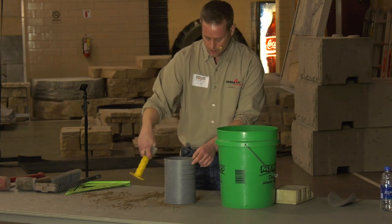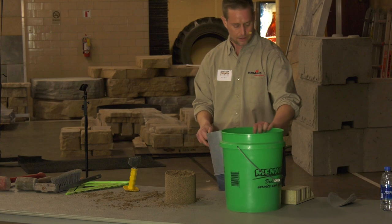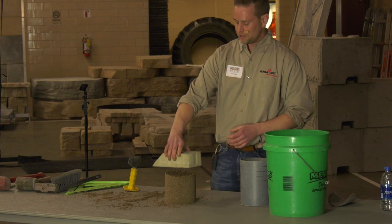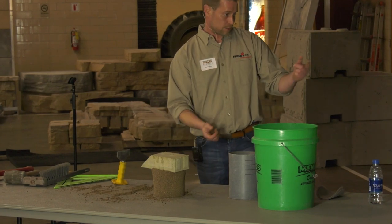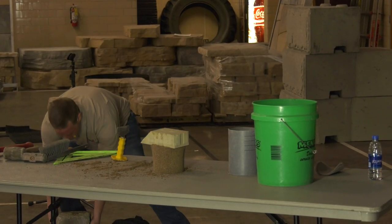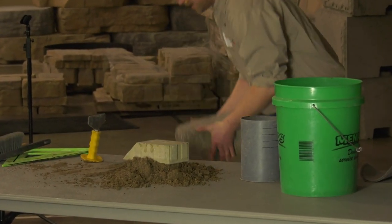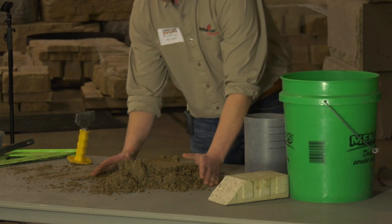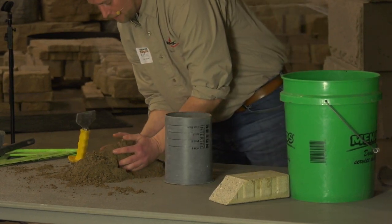Now as we remove our form, we should see this stuff staying pretty well put together — we've got our vertical walls, it's staying in place. But when we add a load or a surcharge to this, we can see it's starting to slump off. If we add another block, we can see that immediate failure occurs. Even though we compacted our material, that down pressure was enough to blow out the sides of our retaining wall had we not used any reinforced backfill and geogrid.